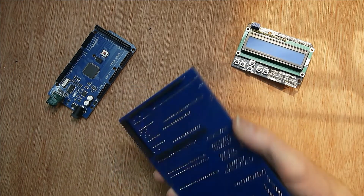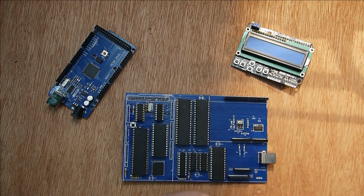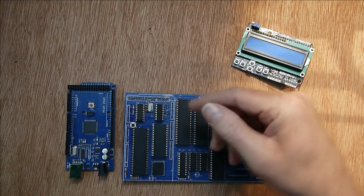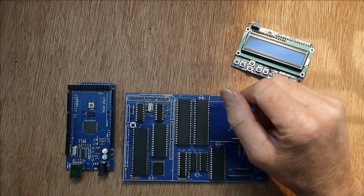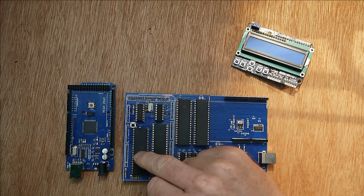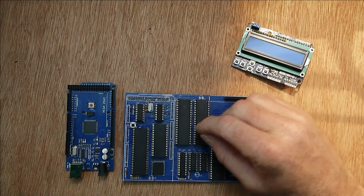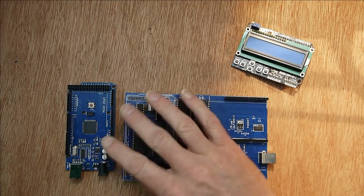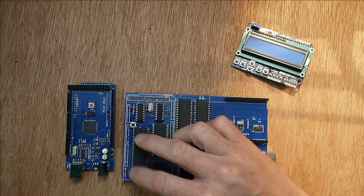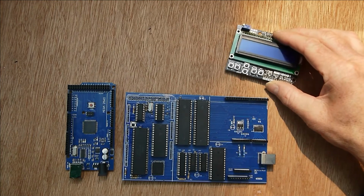So yeah, it's a single board computer, or a complete sort of logic analyzer if you like. The Mega becomes a logic analyzer sitting on the bus. It can also drive the bus. You can also, if you want to, emulate the hardware that's on the bus. So that's where the Z80 executes, but the Mega provides data at certain addresses on the bus, the I/O or the memory bus. It handles both. So you can emulate hardware on the bus if you want to when you're running at the emulated speed. Obviously when you run as a single board computer that doesn't exist and the hardware would disappear.